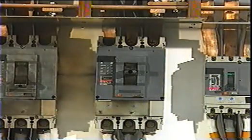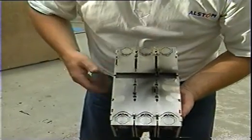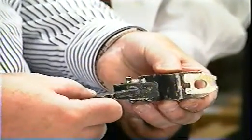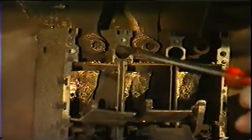After one operation, the contact resistance of this 400 amp circuit breaker increased 4 times. Clearly, it will be unsafe to reset this breaker and expect it to operate within specification. An inspection of the contacts also revealed significant damage. This second breaker was extensively damaged. Arc products exhausted out of the device, causing additional arcing on the line side bus bars.